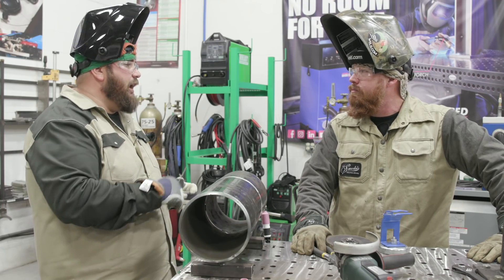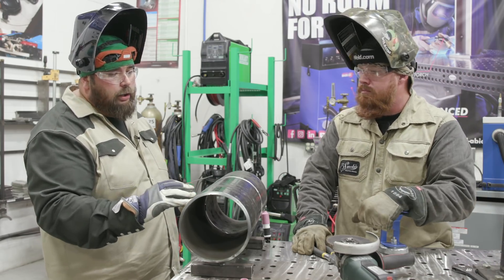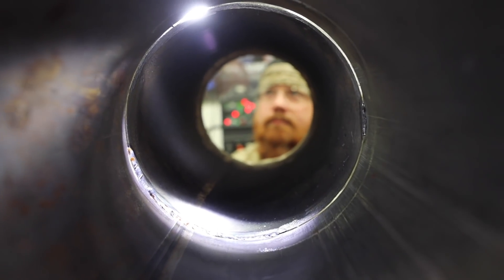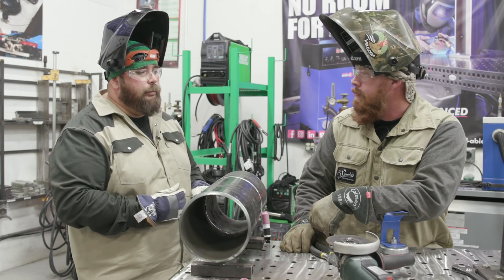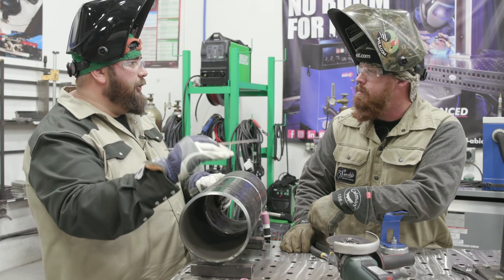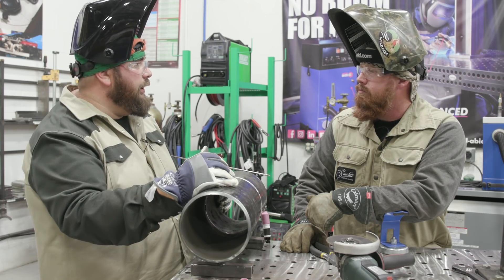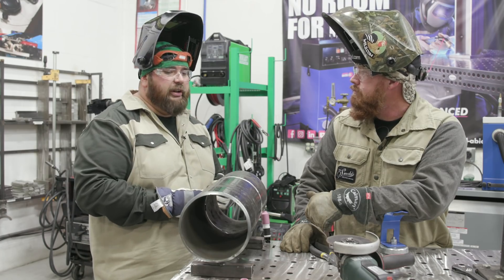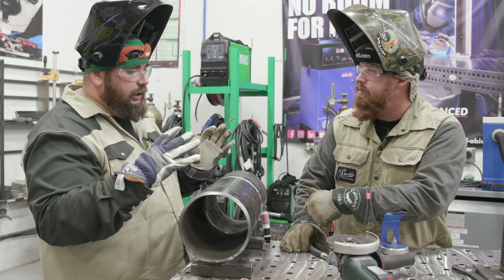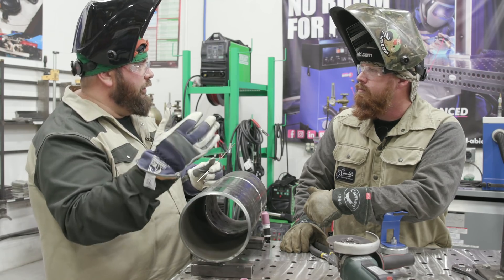So they try to eliminate, in the welding process, things that would let them hit minwall quicker. They'll take a welding procedure and tell us an eighth inch, and say minus a 64th or minus a 32nd. It's stricter in the nuclear industry than in general power. More times than not, if you tacked up anything bigger than an eighth, you could be looked at on your tack-up. We want a tighter gap, and you have to be able to get some reinforcement in. Suckback is not acceptable. Flat would be acceptable. Some codes say 3/32nd is the max; other codes say an eighth inch internal reinforcement is the max. On this one, we're trying to achieve around 3/32 of internal reinforcement. The best way to do that is to tighten up your fit — the looser the fit, the more internal reinforcement because you're putting more deposition.